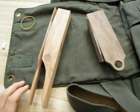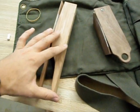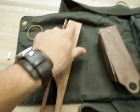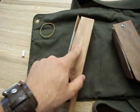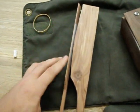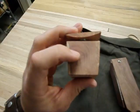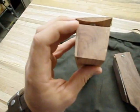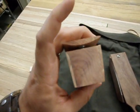I wanted to go over a few measurements for these calls. The overall length of the big call I made first is 11 inches. This right here is one and a half inches, and it's the same on this end. Now in the center of your arch, you want to add a quarter inch, so that would be about an inch and three quarters. The width of the block of wood I cut for in here should be one and three eighths, and you'll want to cut your bevel down from that. There's a quarter inch on each side for the wood, so that makes it one and five eighths total width.